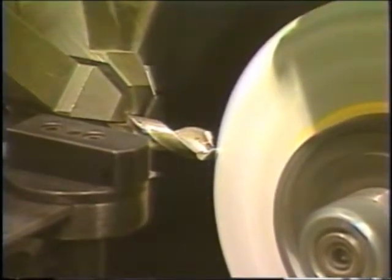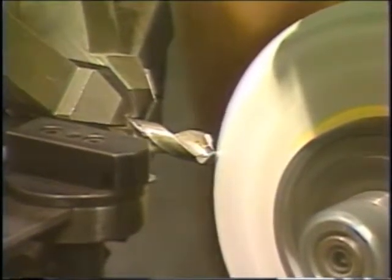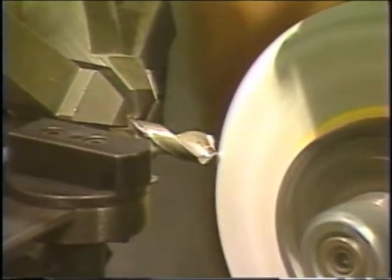The tip that you want on this drill — you don't want a very high fragile peak, and you don't want it flat either. If it's flat it's not going to center properly, and if it's too high and peaky it'll tend to break off, so you have to have a nice radius tip on it.